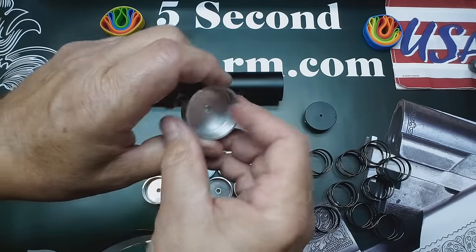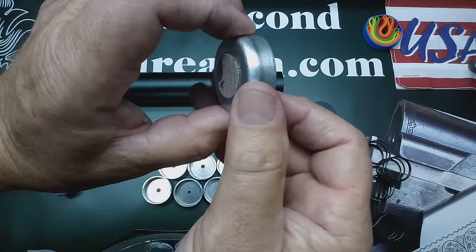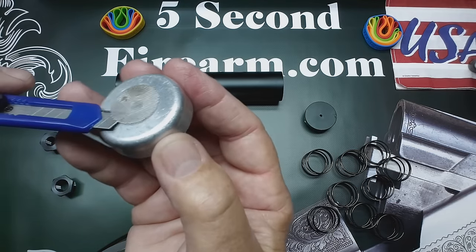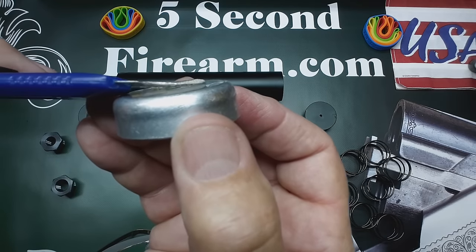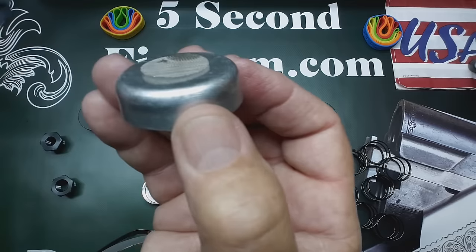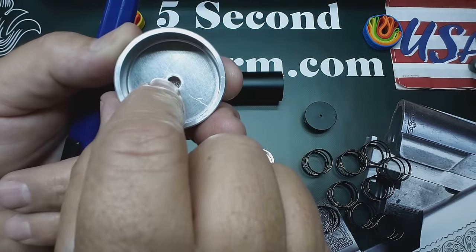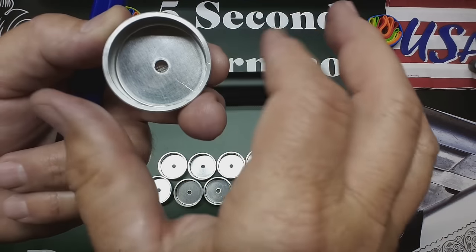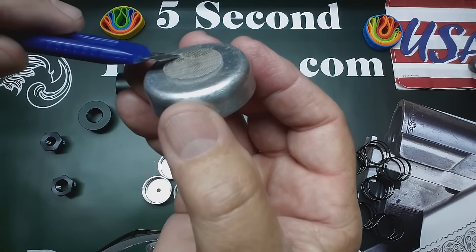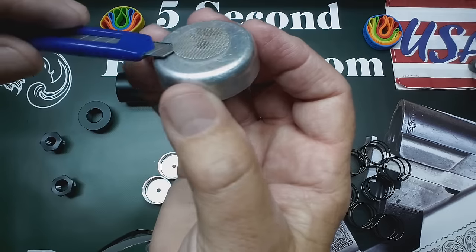We also give you 9 aluminum cups, and these are 2 millimeters thick. Each cup has a stainless steel screen already bonded to it. The reason we bond the screen to the bottom and leave some open area is so your solvent can drain and debris stops in the screens — if we put the screen at the top, the solvent would plug it up pretty quickly with debris and you wouldn't get filtration all the way through the unit. So these are made with a little bit of a bypass, and the screen is stainless steel, not aluminum and not copper.